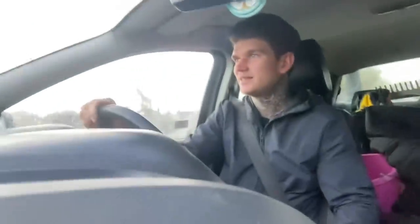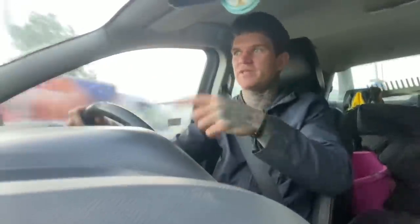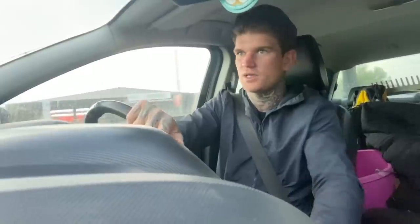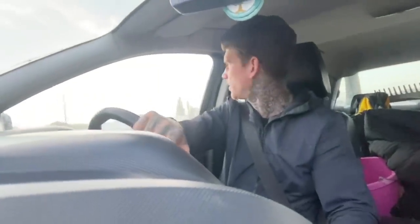What was the plan today? Load out a load of blocks. You're going to help load out some blocks, are you? Right, I've just got to get the outside up to the same height I did on the other one so I can mess about with setting the internal walls out so they're all going off from my profiles, and then I'm going to build the outside and then the inside. So yeah, let's get it working.